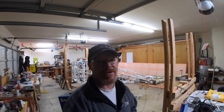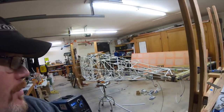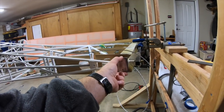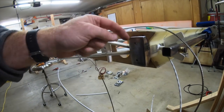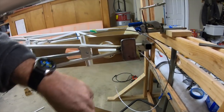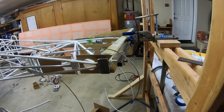Today's project was to beef up the bracket on the back of where the tail spring mounts. There are two points where it mounts — the front bolt and this back plate. I went ahead and put a doubler in with a piece of angle that comes around the edge, plug-welded it to the frame, then seam-welded all the way around. It came out pretty good. I just need to sand down where the powder coat got too hot and then paint this area to corrosion-proof it — it will be covered with fabric for the most part.